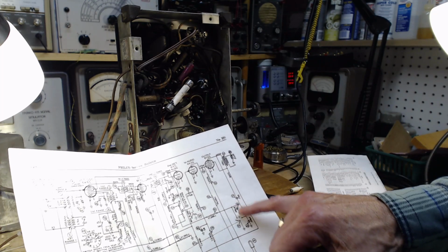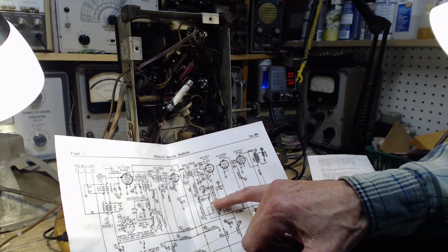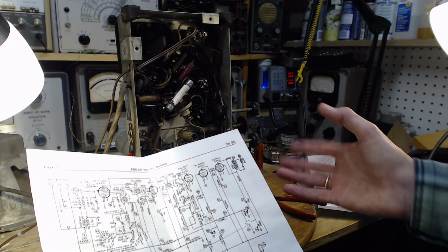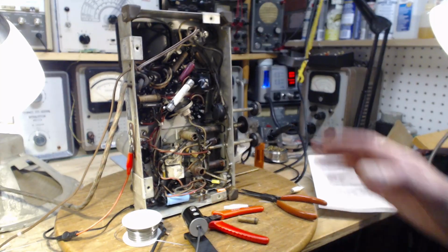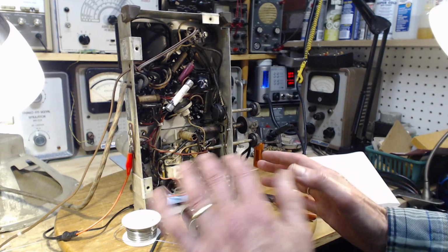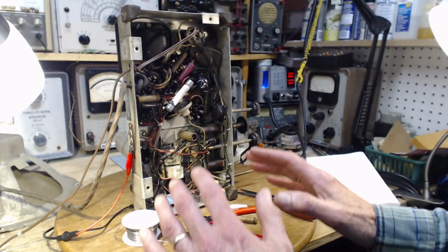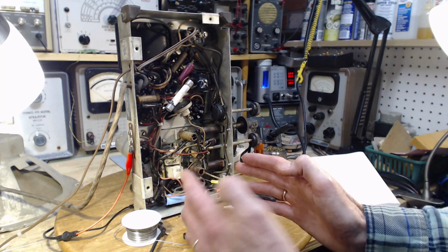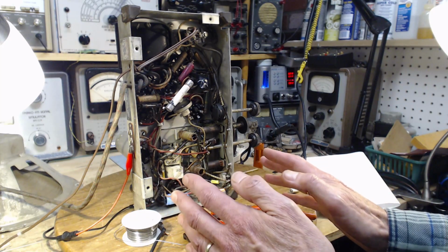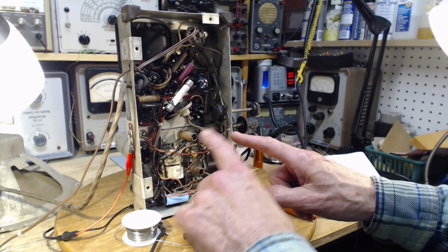And that's interesting because you use the terminal coming out the back of the volume control as sort of a loudness deal. So the problem with our ears is when the sound gets quiet at low volumes, we don't hear treble and bass as much. Our ears are designed that in low sound circumstances, we focus in on the voice range, we cut out the lows, we cut out the highs. We don't bother with them anymore. We just kind of concentrate our brain power.